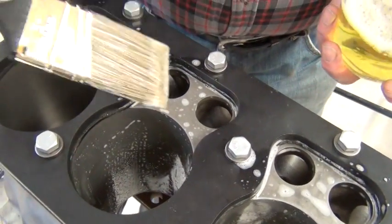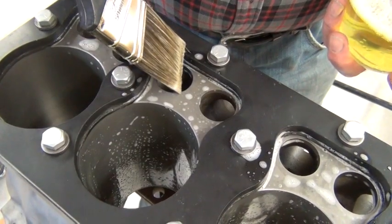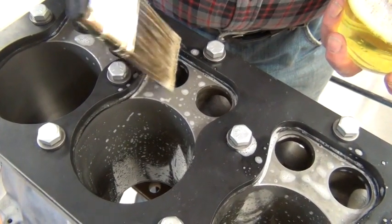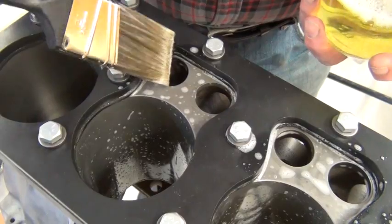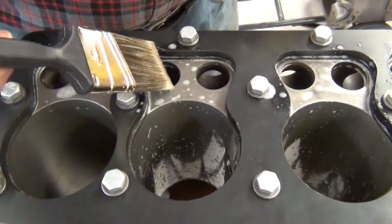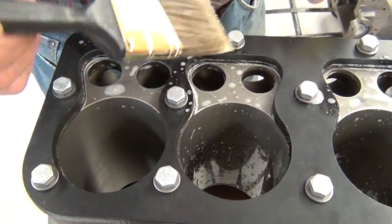But it's the little sneaky ones that sometimes get around the valve seats. I had one block that I had to turn away — it already had a seat in it, but it had a crack that extended beyond the seat and little air bubbles started coming up. Usually on the exhaust seats, if you put it back into service, the water would keep quenching and rusting away the seat, and the seat would eventually pop out.